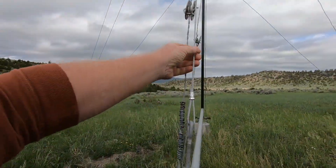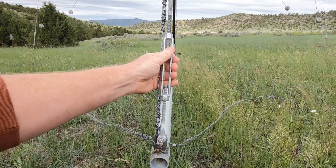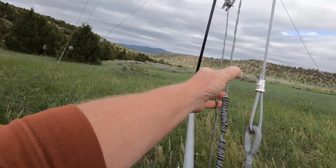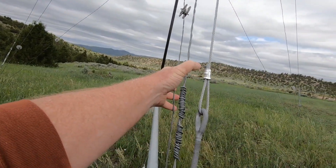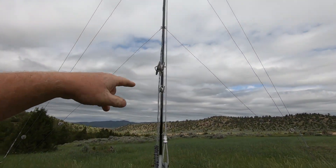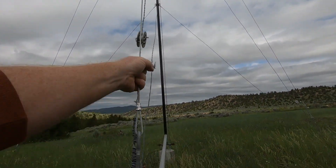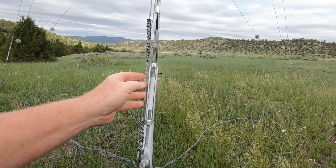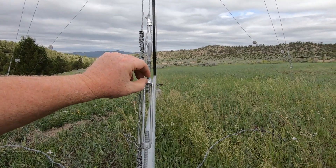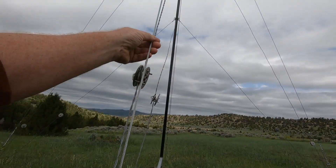You see how this cable is twisted — this is important to know, because this turnbuckle looks like it would be a flawless setup. I added these wires, which is what I've used on previous wind generators and it worked fine, until I assembled this tower and had a failure. So I went with cable on the top strand with turnbuckles — somebody had suggested that — and I was pretty satisfied with it, but this thing was hanging on by only a couple of threads.